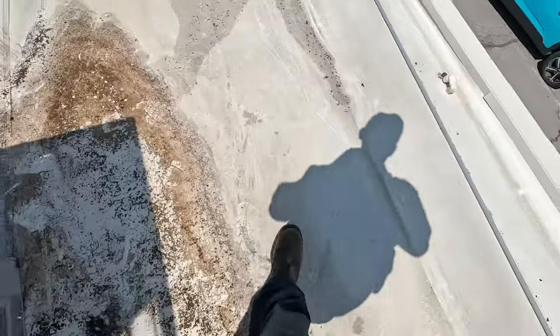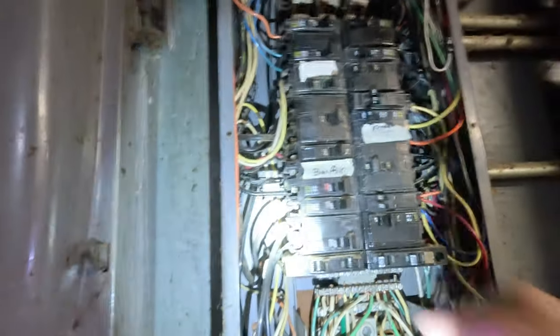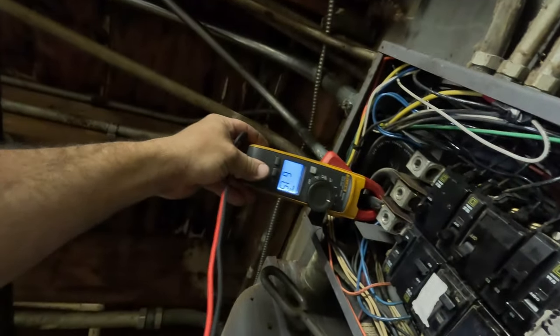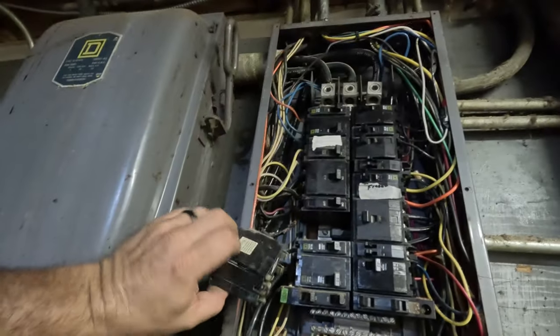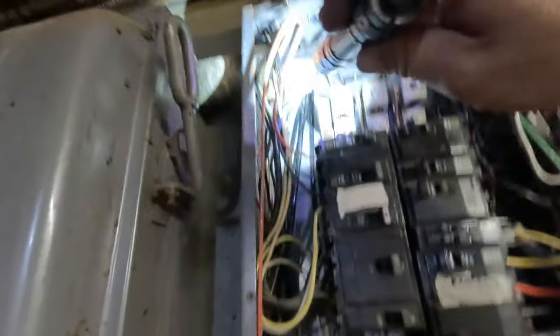Let's go downstairs. Oh, there's a trap — nice. Yeah, we've been resetting it over and over. That wire's all burnt up. I can't imagine our box is not overloaded here. We're pulling 61 amps without the air conditioner running. 59 amps on that one too. We're going to go ahead and kill that one. Oh yeah, look at that — I just ripped right out of it. So that was probably loose.